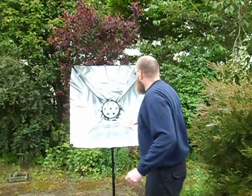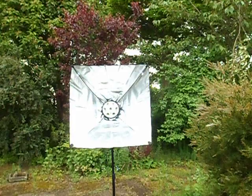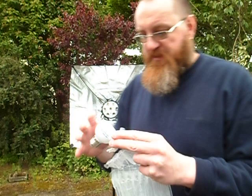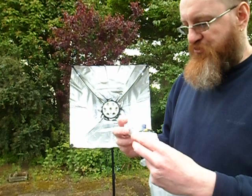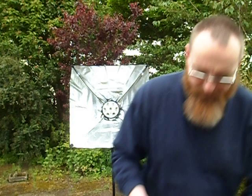Now at this point you're ready to put the lamps in. If you're very lucky, the lamps — which come in these nice bubble-wrapped envelopes — might be intact. Or if you're unlucky, you may get a pile of broken glass and dangly bits. It's worth noting the electrolytic capacitor inside is rated 400 volts at 10 microfarad, which means there's going to be less ripple than a typical cheap compact fluorescent. Unfortunately, one was broken.